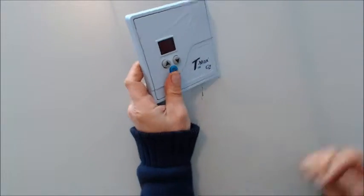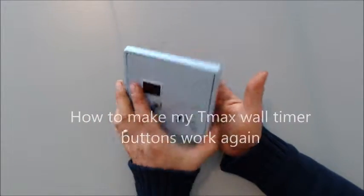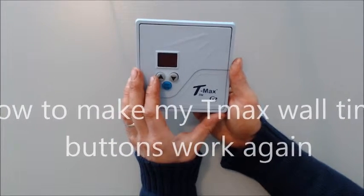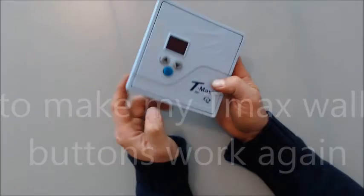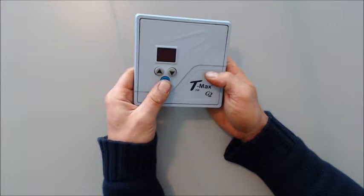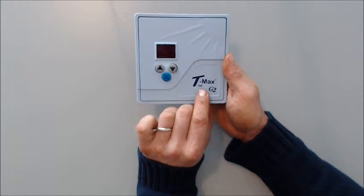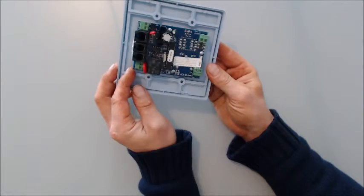This video is about if you have one of these Tmax timers, or what's called an ELO5 timer, or a Sundash 332 Pro or a Soltron Seashell, which have the same kind of protruding rubber buttons, the three of them there, and they stop responding. Maybe the start button is very tough to get to respond, and you're pressing harder and harder, which you don't want to do, particularly on these 3WG2 timers, because the posts that the screws are sitting on in the plastic are really weak.